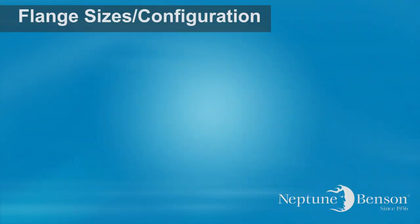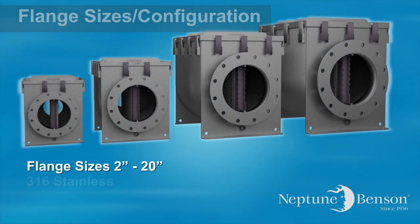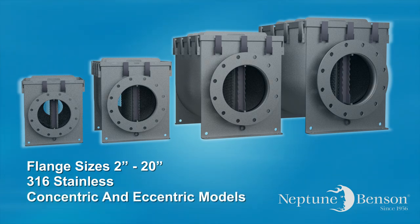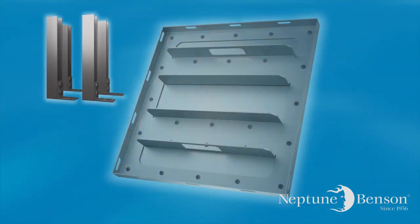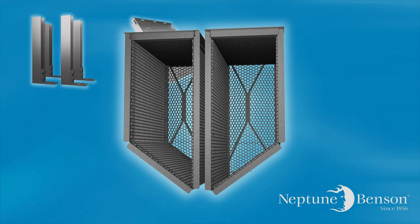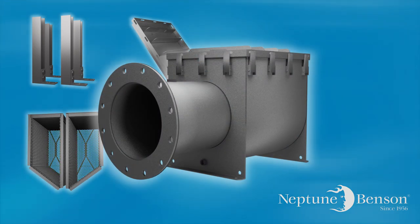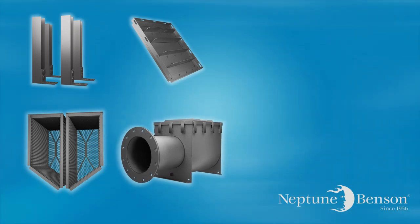Pro strainers have flange sizes from 2 inches to 20 inches and are made of 316 stainless steel. Available in both concentric and eccentric models. Optional features include adjustable mounting kits for easy retrofitting, all-metal lids for high-rise applications, custom high-capacity baskets for 15% more open area, and EFS models with influent nipples 15 inches long to eliminate spooled pieces and ports in the nipples.